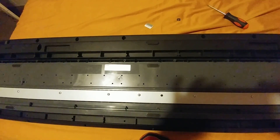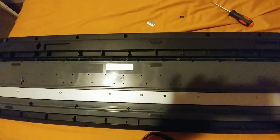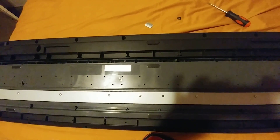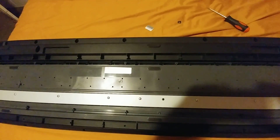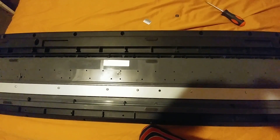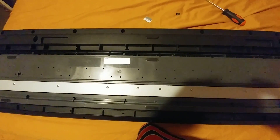It's a good idea — something I do — to lay the screws down in the position I took them out, making the shape of the keyboard, so when I put them back in I know exactly where they go. This is how you fix a corrupted internal card in your Korg Chrome if you're having noise issues. Don't sell your Chrome — it's an easy fix, it just takes a little time.